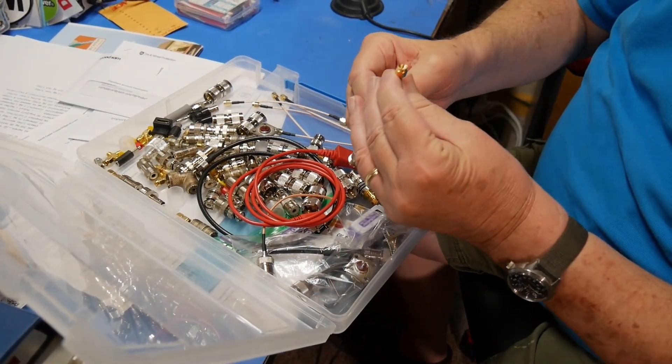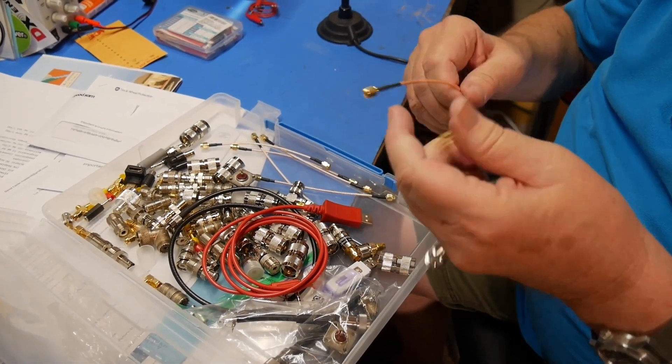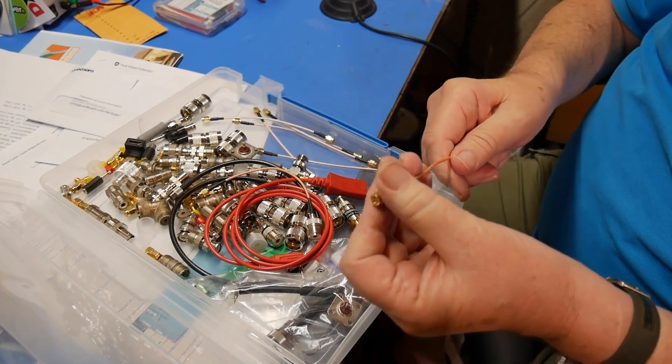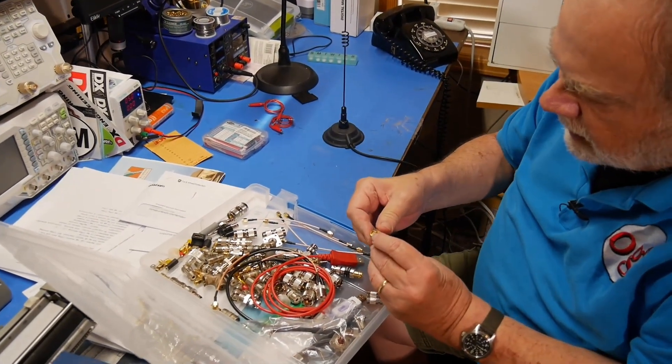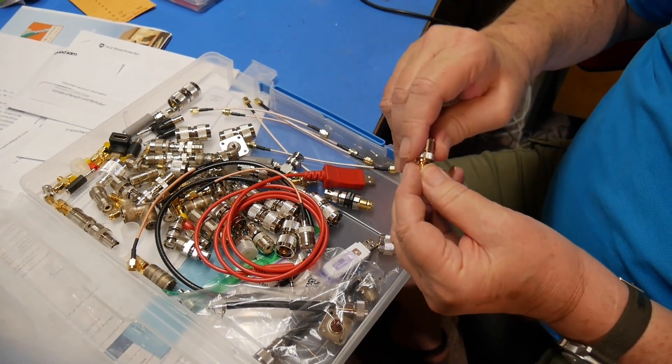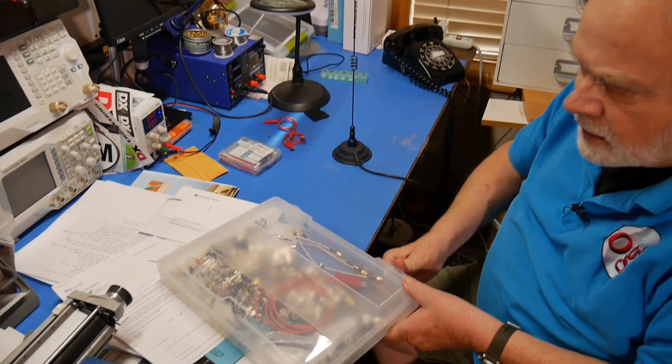Now these will usually have a PL-259 on the end of them, but I want to show you that you can get adapters. Here's one — this is male for a radio that's female. You can get these so they're either male or female. This attaches to your handheld, and then this part attaches to the PL-259. This goes into a female and you've got the SO-239 right there. The problem with this is that it puts a lot of pressure on the circuit board doing it that way. These adapters are available on Amazon — you can get whatever you need there. So I can take a radio that has the classic SMA connector on it, the little one, and connect it to the PL-259 that goes up to the antenna on the roof of the car.